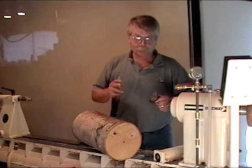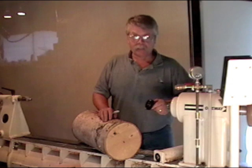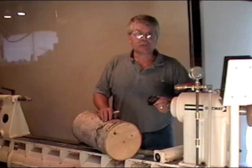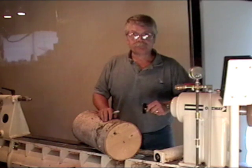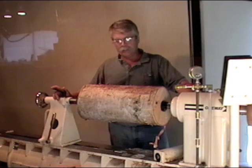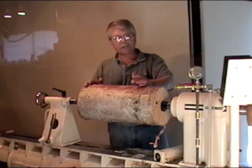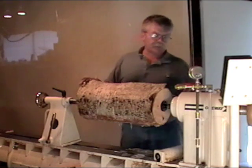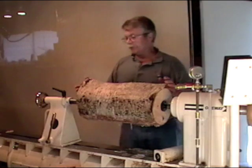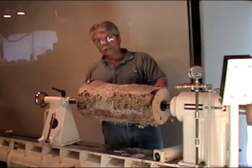Can you imagine? Once you see it on the lathe, you'll just be amazed how else you would do this with a spur drive, as you put the spur drive into the end grain. So when you're doing any deep vessel boring, birch is a great wood to use. I just mounted it on the Elio Drive by just putting it in rough center, or where I want the center to be.